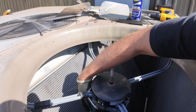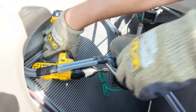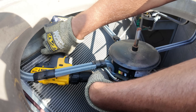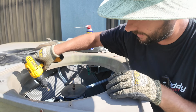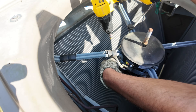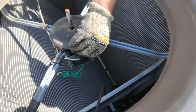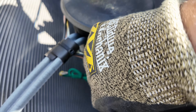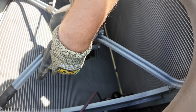There's a ground wire that we have to take loose because it's connected to the motor. We're going to take our drill with a 5/16ths bit. Ground wire is loose. Now we need to take our plug and disconnect it — cut the zip tie, and then disconnect the plug. That's the power for this motor.